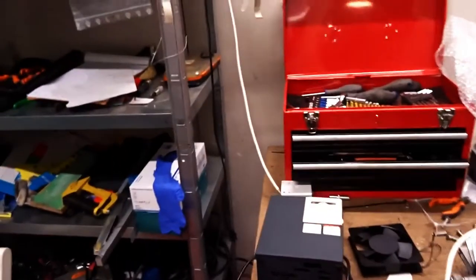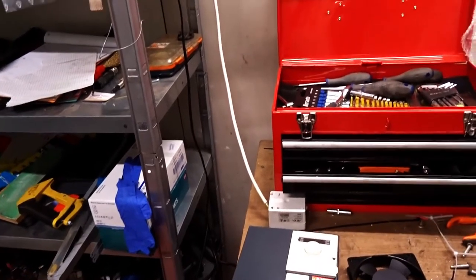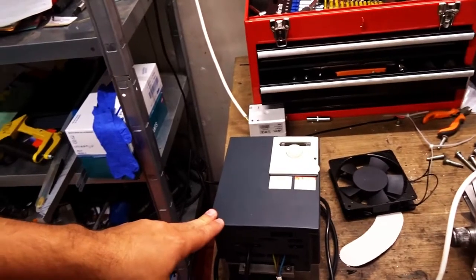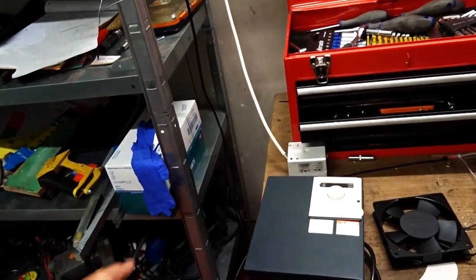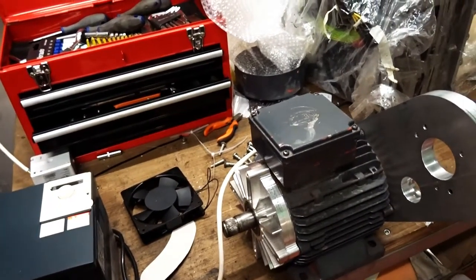So, I'm kind of halfway through the conversion right now. What I can show you is the hardware that I have found. This is a Siemens VFD. I'm planning to completely remove the gearbox and use that VFD to drive the spindle from like 600 to 6000 RPM. And this is the electric motor